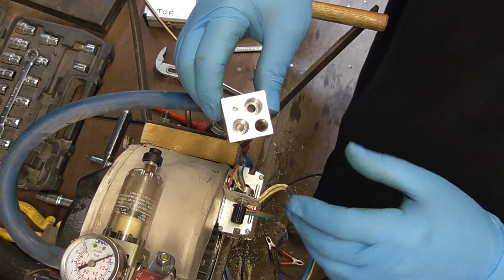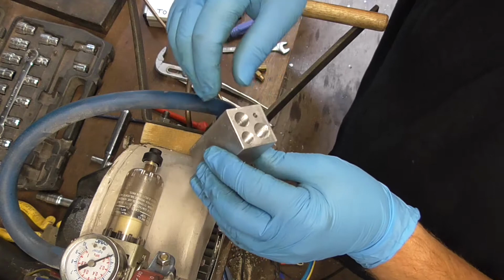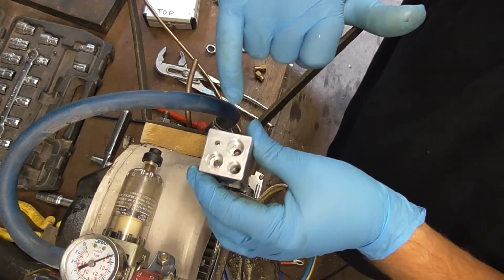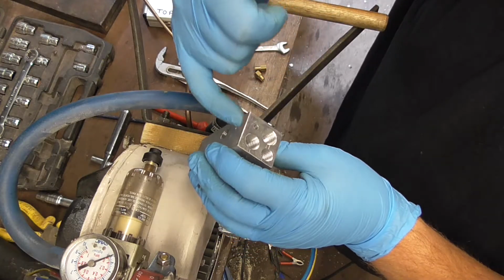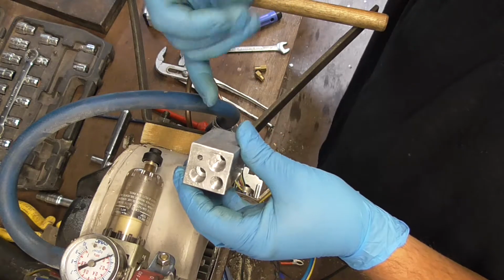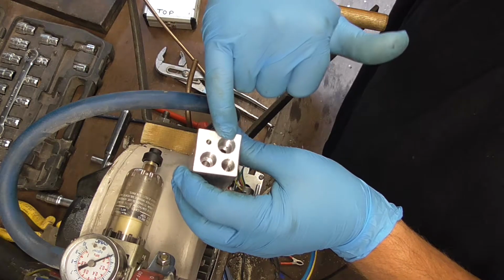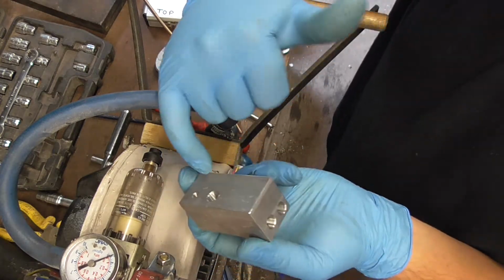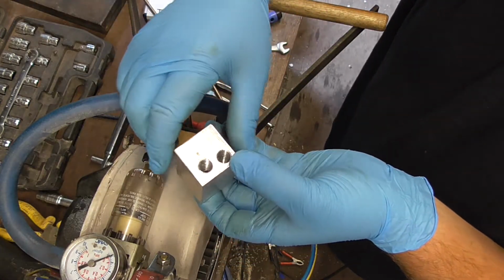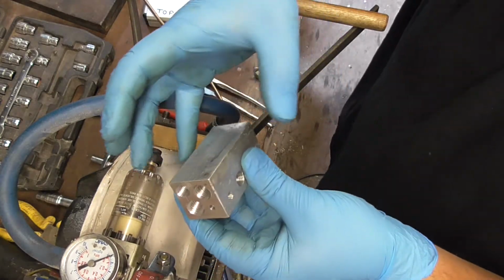Right, I thought I'd just show you the bare aluminium block as it is before there's any fittings or anything in it. And I say there's two heating systems. Glow plug in the block and glow plug in the oil. Obviously it's still in the block. So one glow plug would be in there, and the oil would flow in here, round the glow plug and out of here. And the other system, which is the glow plug, goes into a blank hole, which just heats the block.